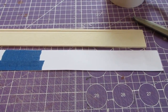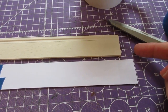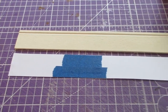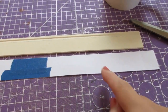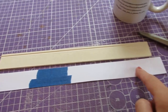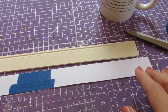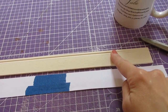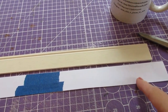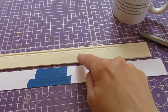I've cut the paper template straight now and it's actually only about half an inch or 12 millimeters longer than the original I made — I wish I'd done this in the first place. I've also gone back to measure it again just to make sure it fits. It's really important to keep measuring at each stage of the job; otherwise you'll make one of these, go and try it, find it's the wrong length, and waste a lot of time and materials. Always keep checking — it's quicker in the long run.